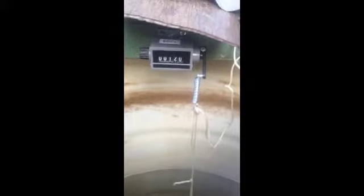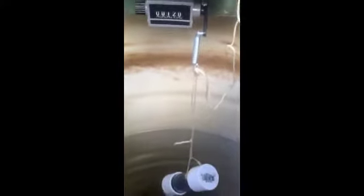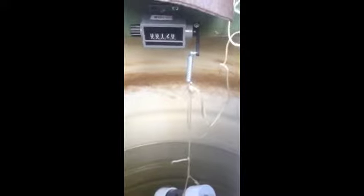Now what does this do? This tells us exactly how many times the barrel has flushed since the last time we reset the counter. As the water comes up, so does the float, which releases the tension on the lever. And then as the water flushes, the weight of the float drags the lever down and the counter turns over one more time.